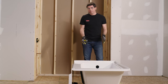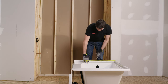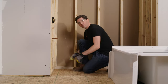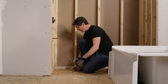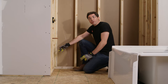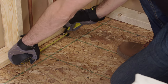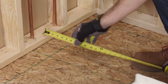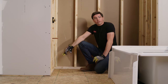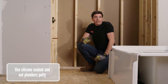Now we can move on to cutting the hole in our subfloor to accommodate the tub drain. First, measure off the inside of the tub to find the center line of where the drain needs to be located, then transfer that measurement to the subfloor on the correct side. The hole we're going to cut can be no wider than 6 inches and no more than 12 inches off of our bottom plate. Mark 3 inches on each side of that center line for a total of 6 inches, and then mark 12 inches out from the bottom plate. Cut out that rectangle from the subfloor, then install the drain into the tub according to the drain manufacturer's instructions.